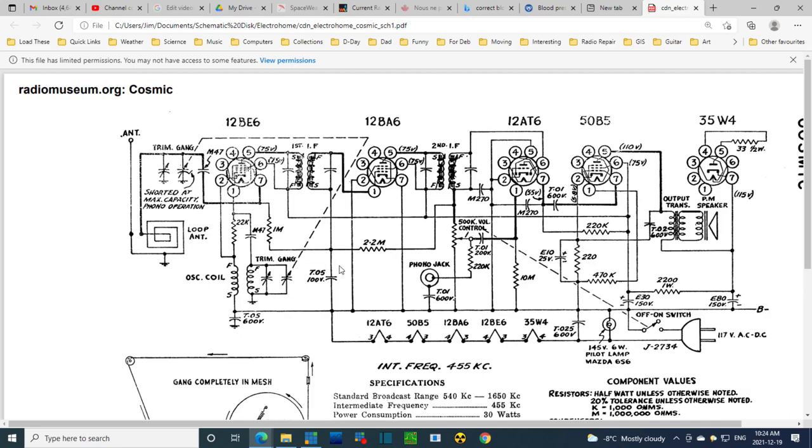Ultimately I'll change this out and see what has happened to these voltages with the same input signals. I'll also test this capacitor for leakage. It's only a 100-volt capacitor so it won't leak a lot, but it doesn't take much leakage in this high-impedance circuit - you don't have to remove much charge to depress this voltage or cause a current flow through this large resistor, just like with my voltmeter. It's a little bit tricky testing these sensitive high-impedance circuits, but with a little care we can get away with it. I'm really just targeting replacing capacitors, so let's get the test going.